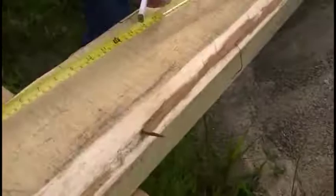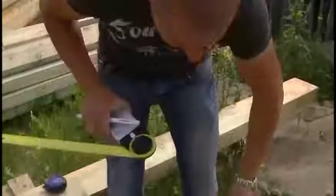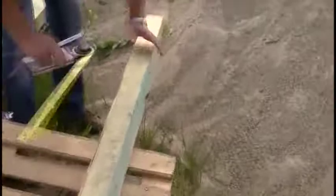This distance is measured at a slant because it is easier for us, being on the roof, to measure the distance between the edge of the wall plate and the edge of the hip rafter. Because the hips and the jacks have different thickness. And if we wanted to measure the distance from the bottom of the hip rafter, it would be hard to hit the right place. Now we draw the cut line around the rafters.